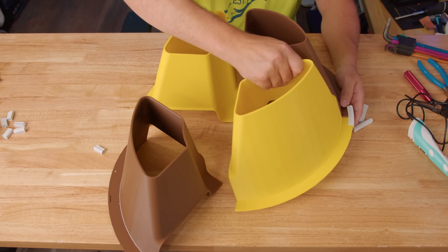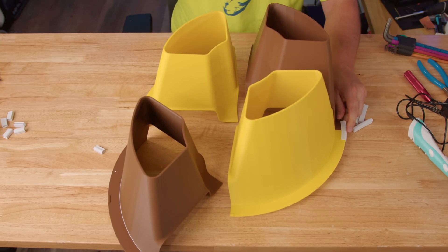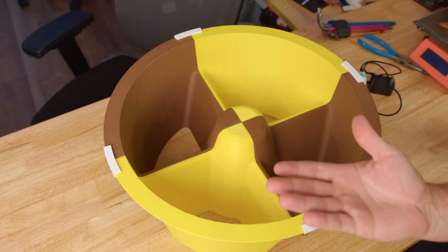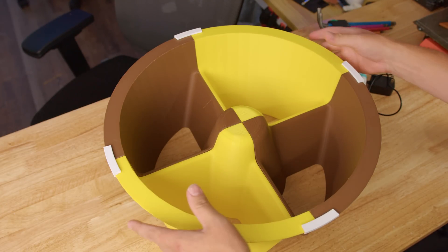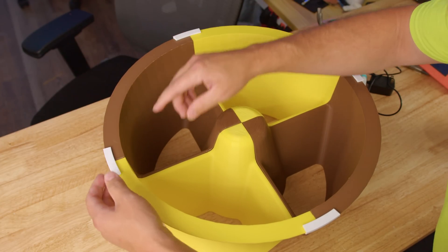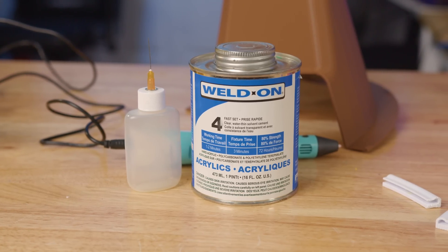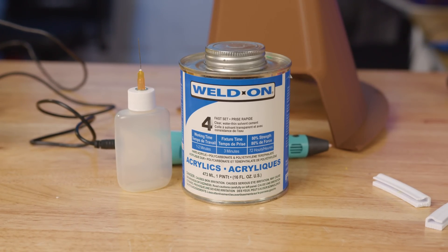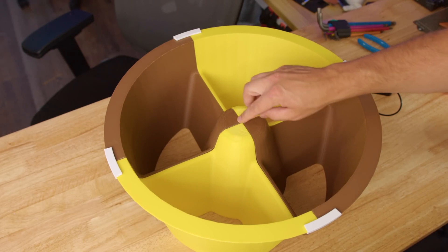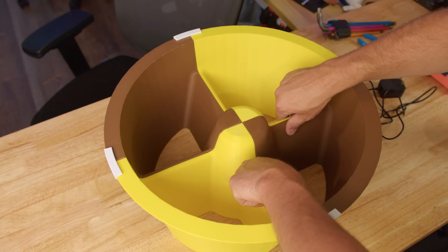That went on pretty good. Having the shroud face down is actually quite helpful — it's very flat on the front face, so it sits nicely and balanced, making all the edges much easier to align. Even once everything is nice and tight, there are still some gaps to deal with. To glue it together I'm using Weldon 4 — I've used it on PLA in the past and it works really well. Weldon 4 is really made for acrylic, but it works great for PLA. This is all printed in Voxel PLA+, and it should glue up just as good. To seal the gaps, I have a cheap 3D printing pen that I'll run around each seam to make it airtight enough to function as a fan shroud.